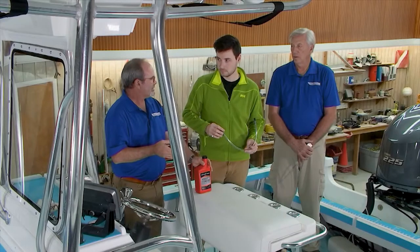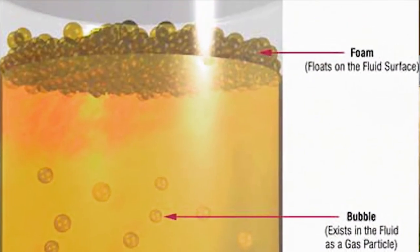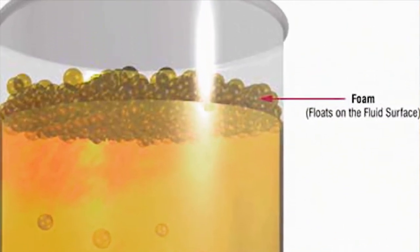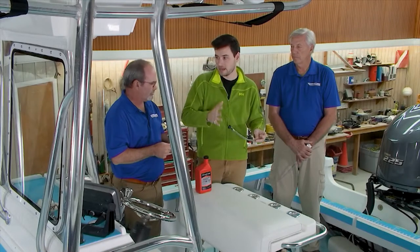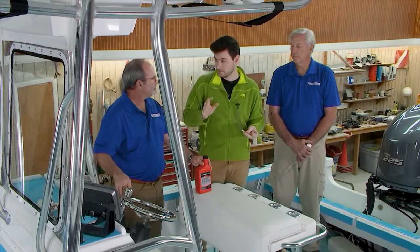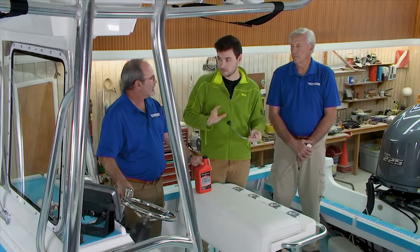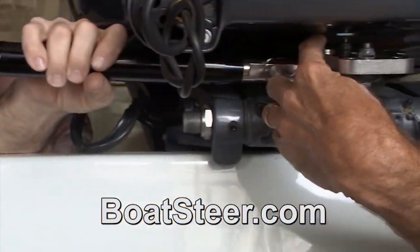At that point, you're going to want to wait until the next day, because you are going to have some micro bubbles in the oil. They're little fine bubbles that, as you're bleeding the system, cause a little oil foaming — little fine bubbles that get in the oil and form big bubbles again. That's why we had the play — we didn't go back the day after we refilled our system to get those bubbles out. Once we've done that a day or two after and let it sit, then it's going to be rock solid.